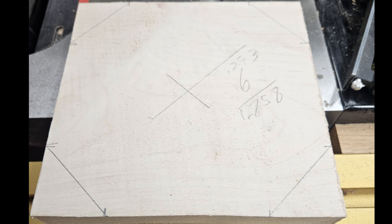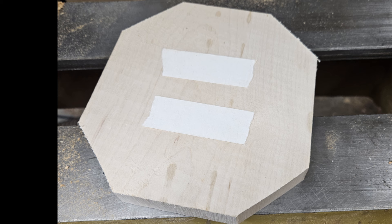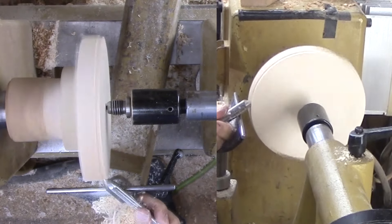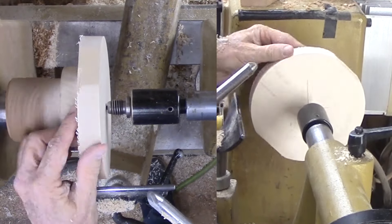For the puzzle tray, I cut off a 6-inch square piece of hard maple. After finding center, I also marked off octagon sides to facilitate rounding it off. Then with a bit of double stick tape, I pressed it against a faceplate. Maybe I could have gone without the tape but it does give me a bit of security. Now the bottom side is pressed against the faceplate. With the corners cut off, I can quickly round it off with my bowl gouge.